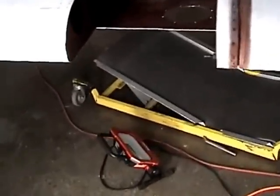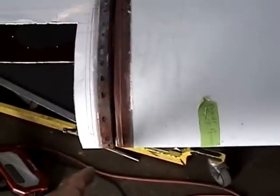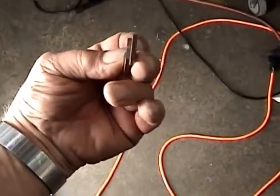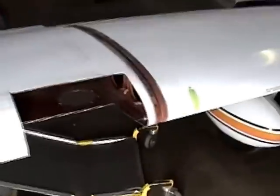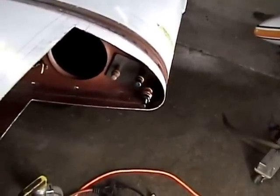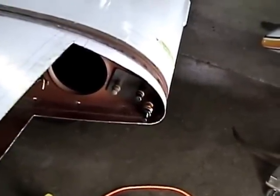A little further along on this thing, cut out a bit more. That's the area that we're going to have to actually replace. We still got to cut out here onto the ribs and down and over and down there. And we closed up this gap here. This rib had been pulled in and it popped the two rivets that were in there with spacers in between them, which are actually these little spacers here. And I've got it drawn together there now with doubler plates. I got one on the far inside, one in between, and one there. I'm going to have to put a thicker one in the middle, but that will draw them all together, and I'm actually going to bolt that forward one. And I may put screws and nuts through all three of them to draw that together and hold it.